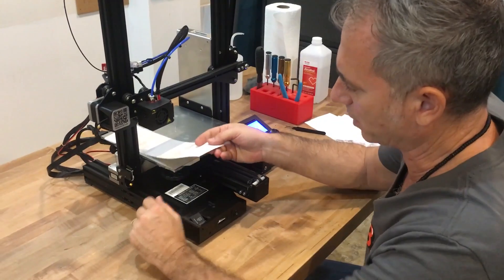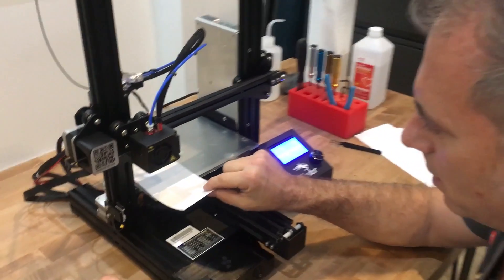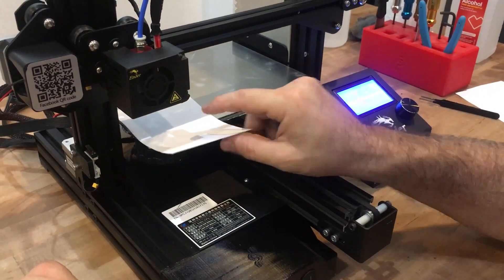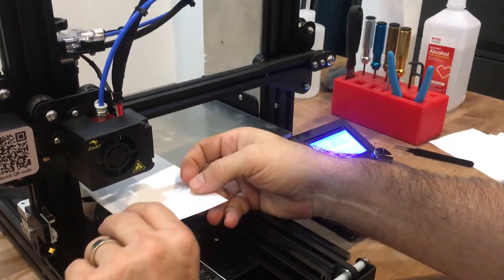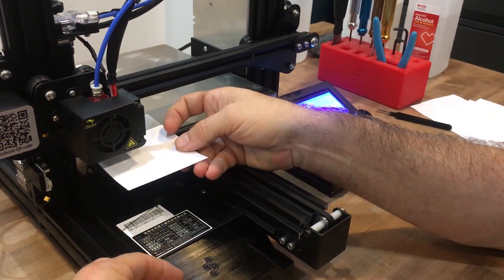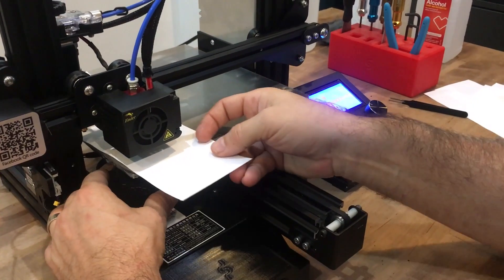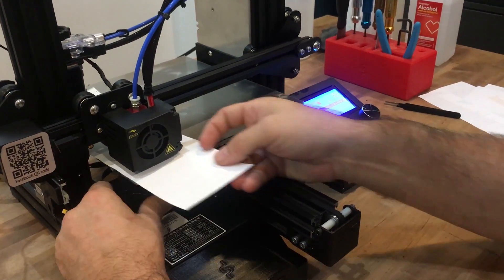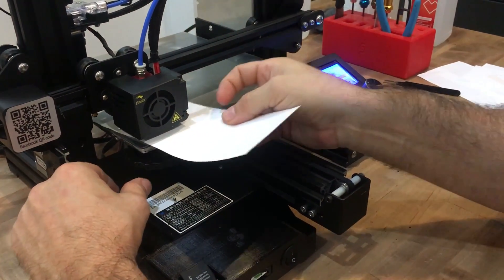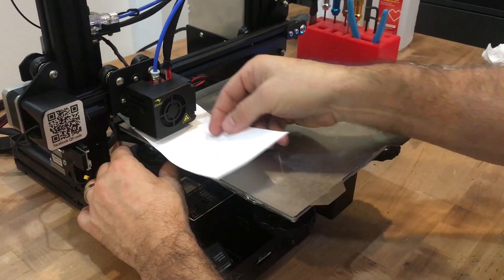I get my paper ready. While it's homing, I generally put it right underneath so I don't have any drips of plastic — using the paper to collect it. One of the goals is you don't want to move any one knob too fast. If you move it too aggressively and the other three knobs are already at a plane, you can risk bending your bed. So you want to move all four knobs in a very progressive fashion. I want to feel that there is grip — right now there's no grip, so I'm going to move the knob until there's grip. If there's too much grip that I can't push the paper underneath without it bending, it's too much. I don't want to put any tension on the bed while doing that, because there are springs.